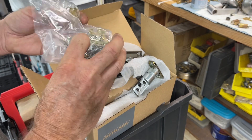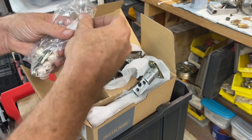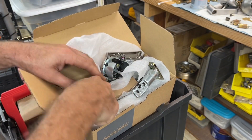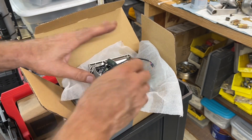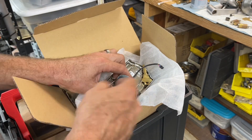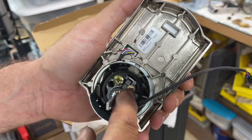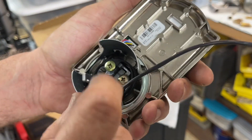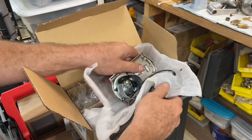I'm curious whether this has the security strike — it does. This one still comes with the security strike. I've been seeing them take that away on a lot of deadbolts, so it's good that it's still there. It just came with one key, so we have to re-key it. I don't have room on my counter, but I do have to re-key it. That's how you take it apart — just pop the cap, unscrew, and it's just a regular double. You can even just unscrew the cylinder at the door rather than carrying the whole lock to your truck.